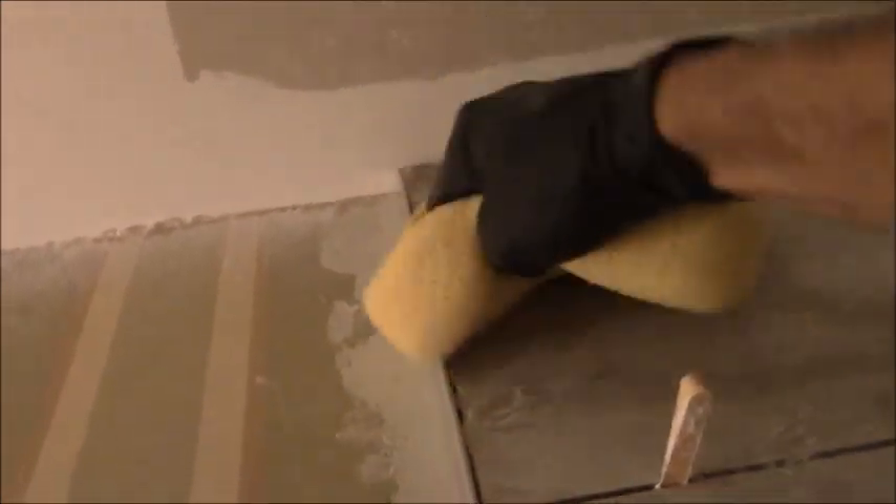That's as easy as it gets. Then you come along with a sponge and wipe off the excess, and wipe it off the wall too if the extra thinset is going to be in the way. If the strip wants to pop back out, push it back in. To keep it in there, I'll run a screw about every foot and a half to two feet.